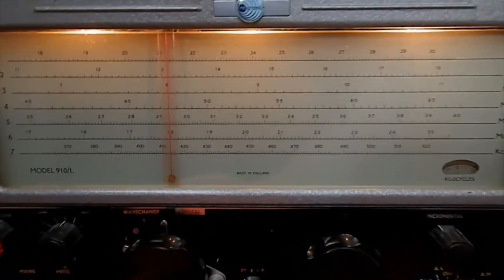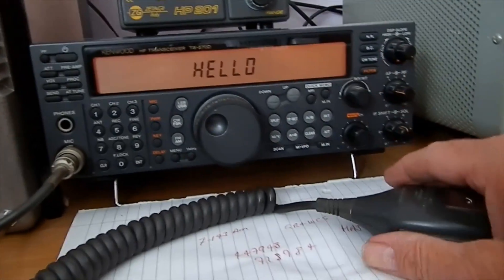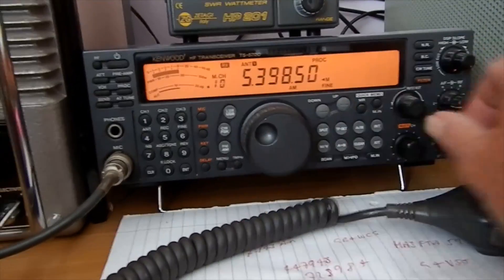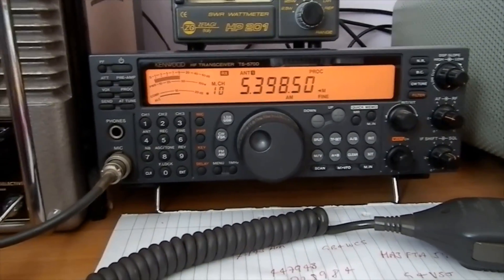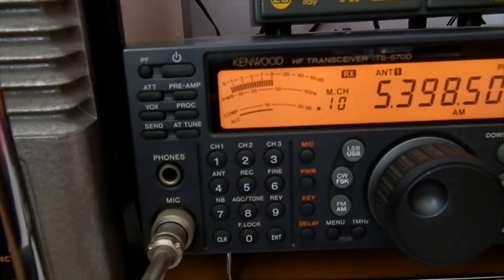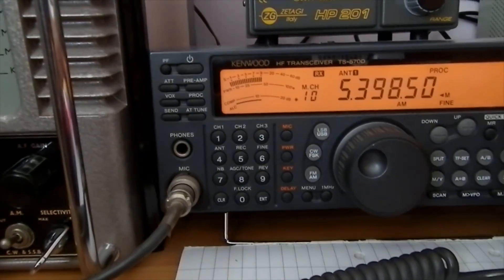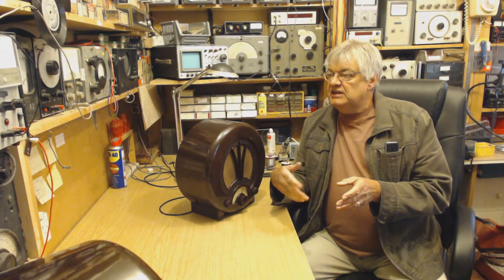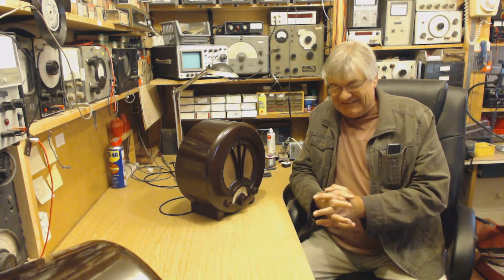It's not too clear on that. This is the S-meter radio rig — let's turn this one on. On AM, it's difficult to hear on sideband, but on AM, there — there it is. There's an S9 on the meter. You can't actually hear it on the video playback, but that interference has a kind of — it's like something is running, like a motor. It's kind of roo roo roo roo roo roo, a sound effect there — but that's what it's doing, it's as if something's running.